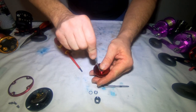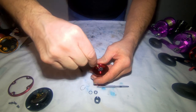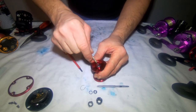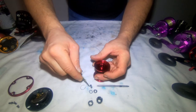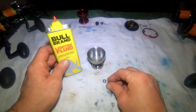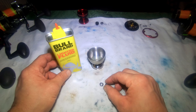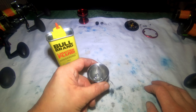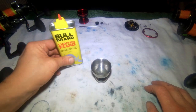Take this clip off here, keeping your thumb over it — make sure that doesn't spring off. Pull this little dry plate out and pull the other bearing out. This sort of bearing maintenance should be second nature. We're not taking the grease out of the bearings today so I won't be using any penetrating oil, because they've already been cleaned — they just need re-oiling. We'll place them in some lighter fluid for about 10 minutes, give them a good soak just to take the oil out of the bearings, dry them out in some paper towels, and then re-oil them.